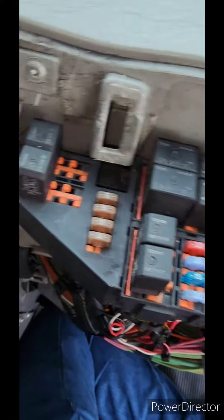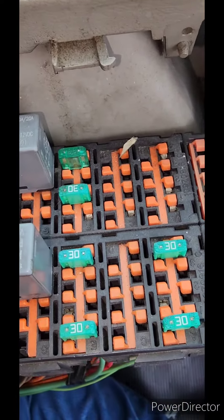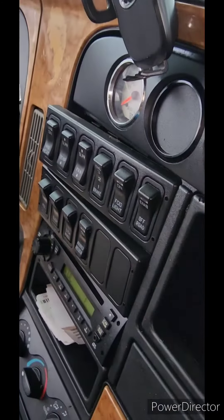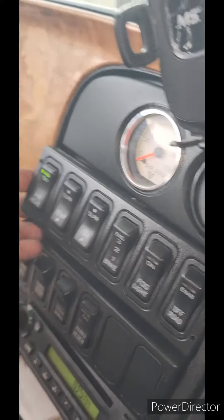There's a missing fuse at F4K. I brought fuses with me, put a fuse there, and rechecked for power. I reconnected the switch panels and confirmed — you have power there.